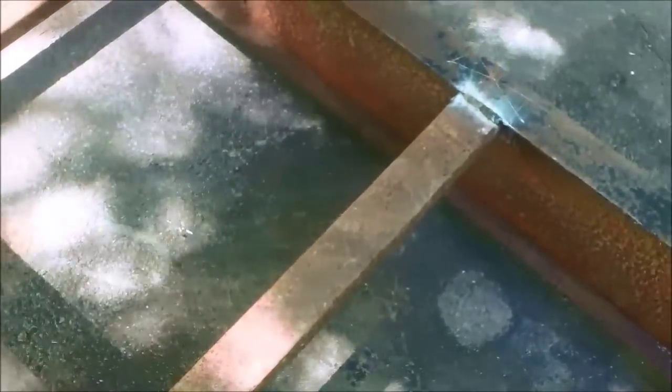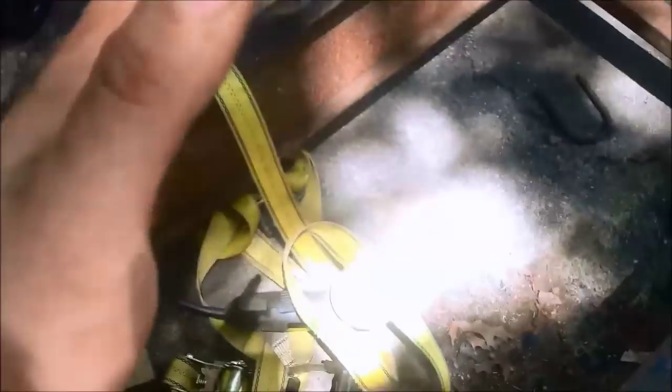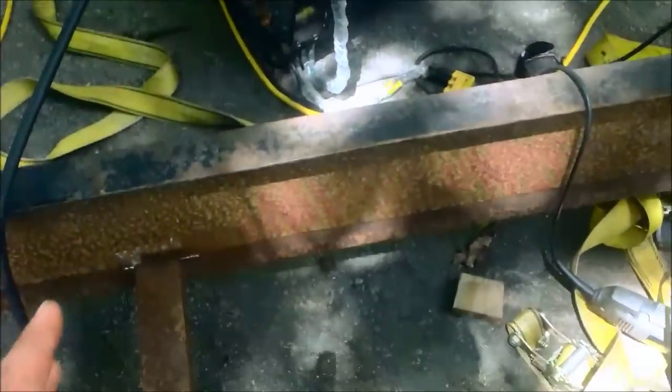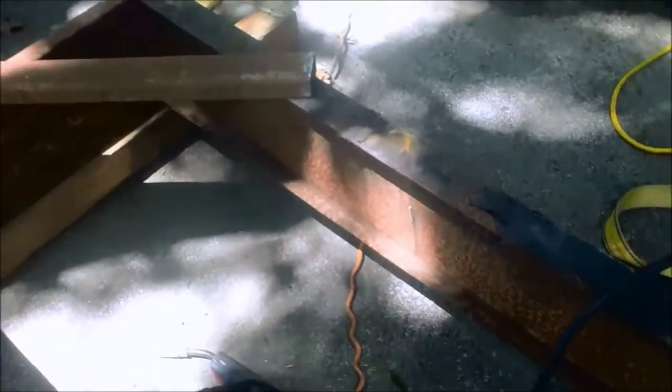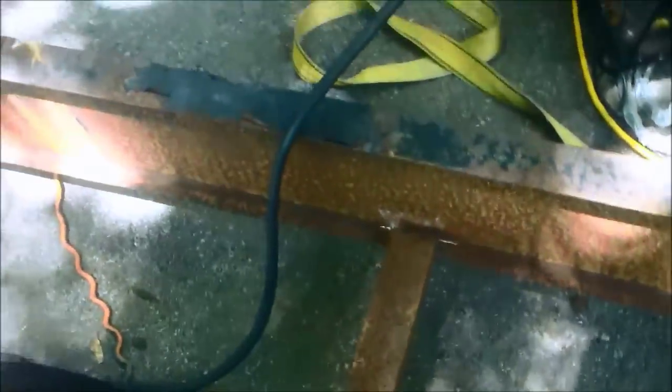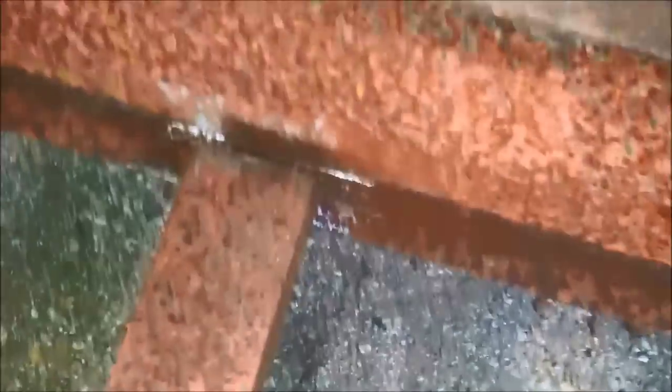So far, pretty square. Now here's where it starts getting a little wonky — there's a kick out of the frame a little bit. As I work the kinks out on this piece, it keeps coming down here, and that's why I didn't weld this end plate on yet. But as you can see here, it's supposed to be touching that piece of metal and it's not. So I'm going to use a come-along — and just like that, it's straightened. As you can see, it's meeting perfectly now.